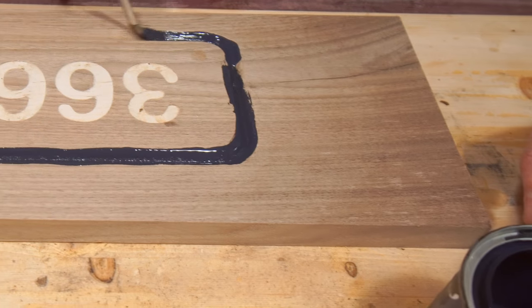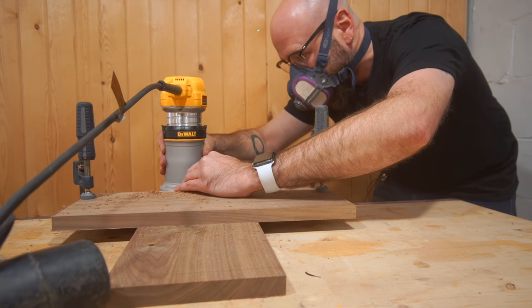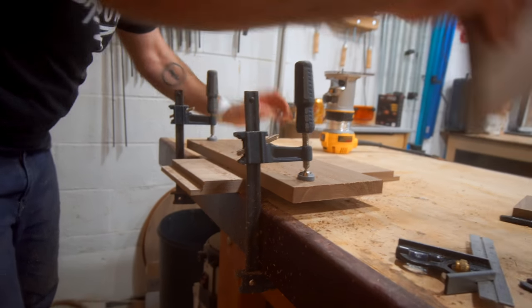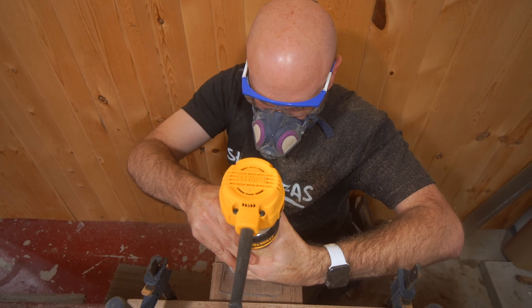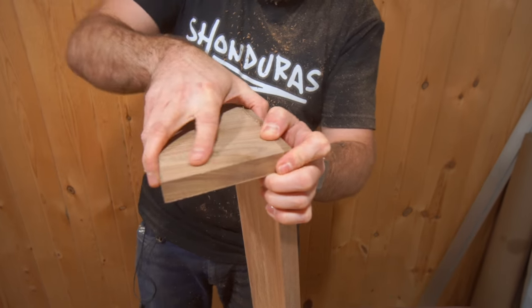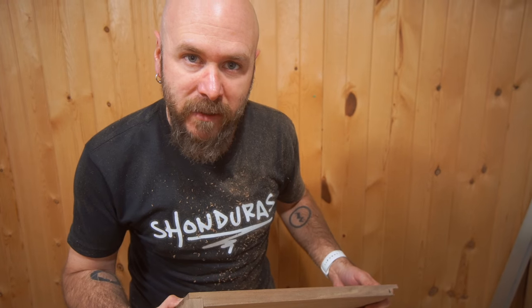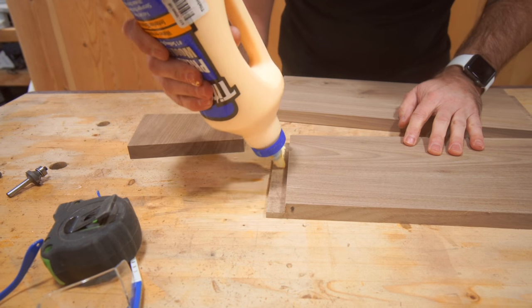Now I'm going to paint this V-groove. I've got a Tools Today bit in my router here and I'm going to cut a rabbet on the back piece. There's no doubt that would be easier — much easier on the table saw. I really do not like using routers. So we now have our little rabbets. What we can do is glue everything up and then reinforce this with some dowels. I ain't worried about it — glue it up, see what happens.